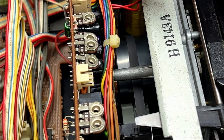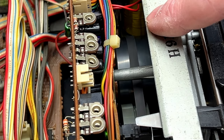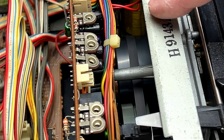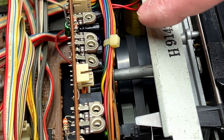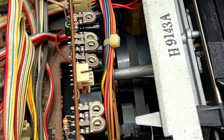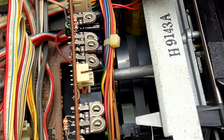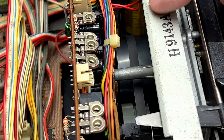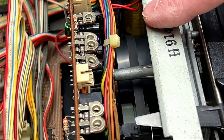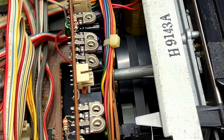And there was already a really thick washer back in there that I assumed was the only one. And no, apparently it needs both washers, and they have to be there, otherwise this motor will not start. There's something critical about those two washers that just requires them to be there. It wasn't an issue of the flywheel binding up on the FG coil at all. It was just the fact that it didn't have the spacing or something that it should have had.